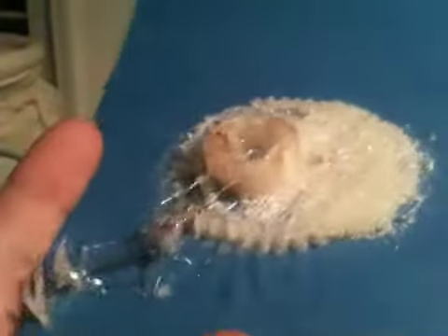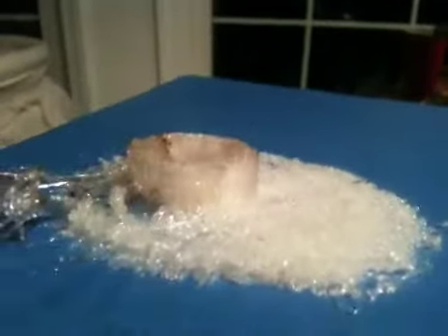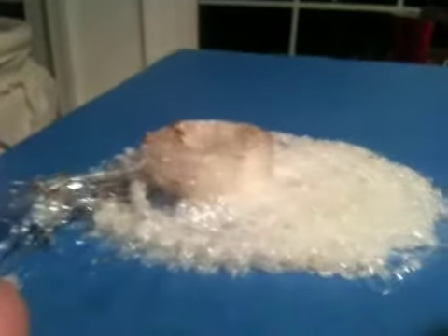I say that because I had that problem with the mini mug, so maybe I have some X calibration issue. At least I'm getting plastic out. And if it wasn't for that spindle holding the plastic back, this would have been consistent and fine, with the exception of the infill going over where the gear is supposed to be. It ended up having gaps of whole layers because it couldn't pull down on the plastic, because it couldn't get a grip.